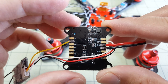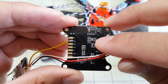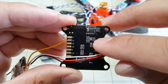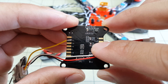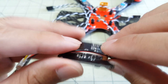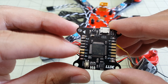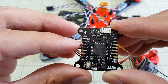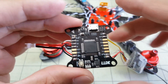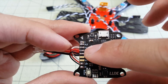A couple of things to note on the Lux flight controller: you need to jumper the SRX on the bottom of the board because you have a choice between PPM output and serial RX — jumper those two for serial RX. Second, you want to bridge the 5V output instead of the 3V. On the other side of the board where I've soldered cables for the XSR receiver, there are three pins — receive, 5V, and ground. If you solder the 3V jumper, it outputs 3.3V — that's for Spektrum users. I did 5V because the XSR takes 5V, and if you plug in USB it will output 5V there.